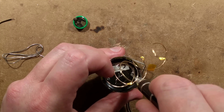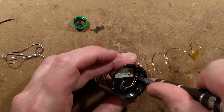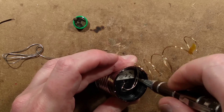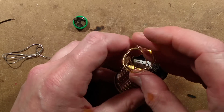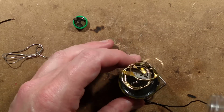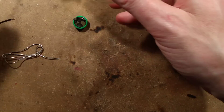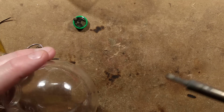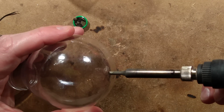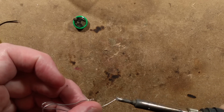The solar panel is putting out a significant amount of current - they're really impressive. These amorphous silicon panels must have evolved - those little brown ones are a sort of coating deposited on glass with various conductive layers. I've always really thought of them as just calculator type solar panels that don't put out a lot of power, but in this case they most certainly do. While I've got the soldering iron on, I shall use it for something dreadfully inappropriate - I'll stick it in the end of the other globe and melt a hole right through the end. That's all it takes; I'll wipe the tip immediately and re-tin it just to make sure plastic doesn't burn off and cause problems.